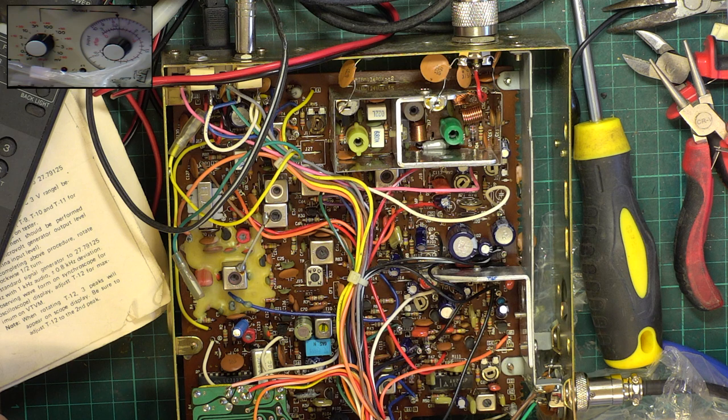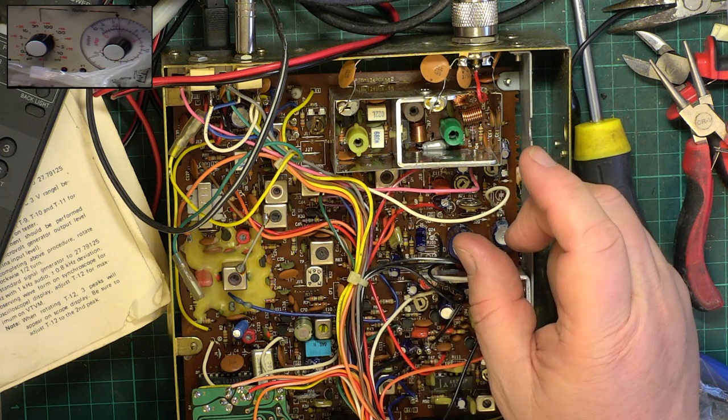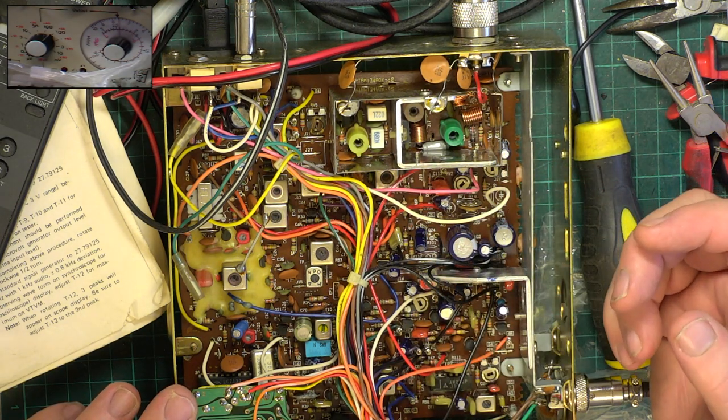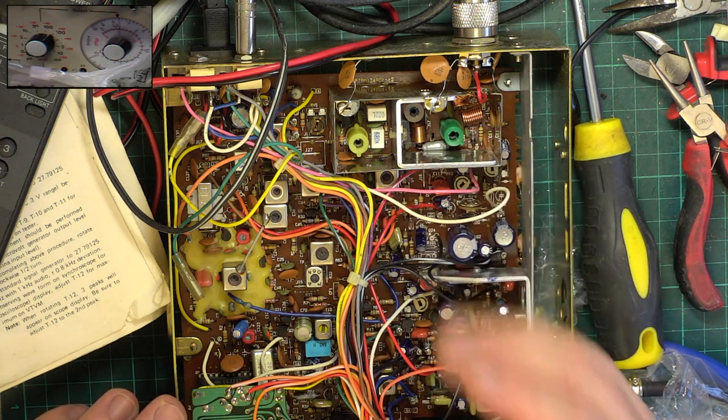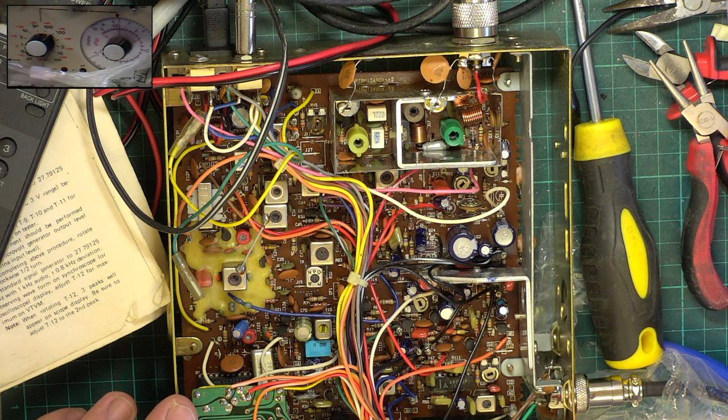Turning out a nice radio. Because there's quite a wideness in performance of all sets which use the same chassis. There really is basically only two versions of this, and what we'll say, the York 861 Rotel 220 has got a little bit something less in the receiver, and from Rotel 230 Harvard 420M onwards, they're all the same. So theoretically, your Rotel 220 doesn't quite perform on receive as well as your Rotel 230 and Rotel 240, but there's no difference between 230 and 240. When you get to that model, there's no difference in innards.